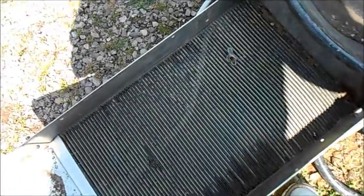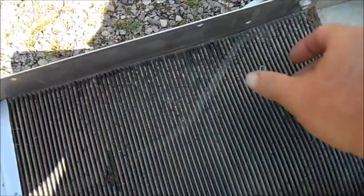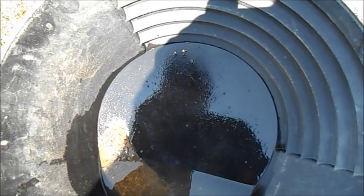And so now next is to clean out the black rib matting. We already saw some gold in there, but we'll see how much more is hiding in there. Okay, I'm pretty happy with what I found. There is 2 more chunky pieces and probably 25 small pieces. Good coarse gold though, and some really fine stuff. That was in the black rib matting, so happy with the way that's working. We're getting more gold as we go up. You know, in the expanded metal and the riffles, there was no fine gold in that at all. So my thoughts were right there.